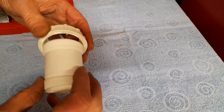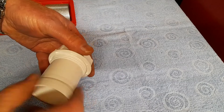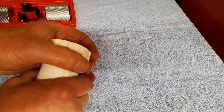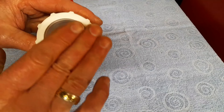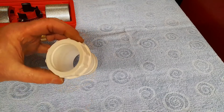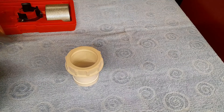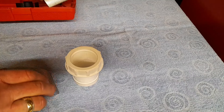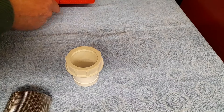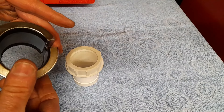Okay so here's that piece suitably modified. As I said, you could have cut it in half and just used that, but I machined the middle bit out in the lathe, reduced it, and also reduced the chamfer on the lathe so it's flat. Then I took all the rubber rings and washers out of it, so basically that just screws on there like that.